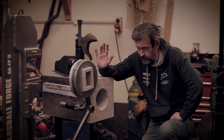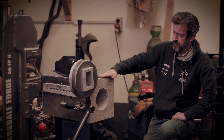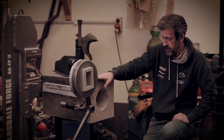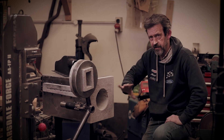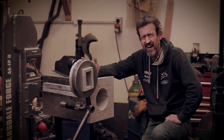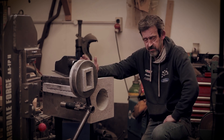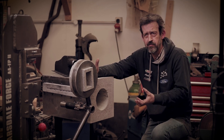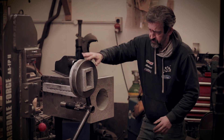Hello and welcome to part two of the ribbon burner vortex knife forge — we'll think of a name later. I've been busy since the last video. I've demolded all of the refractory, taking all the plastic off and taking the pipe out. I used aluminium — absolute nightmare. I wouldn't suggest using aluminium; it took maybe about an hour to get it out. We used every weapon: cutting tools, plasma torch, all sorts. We did get it out and it's done a good job, but something flexible and plastic would be a lot easier next time.